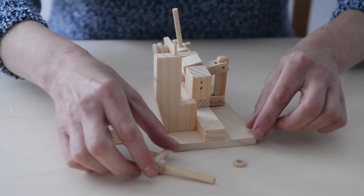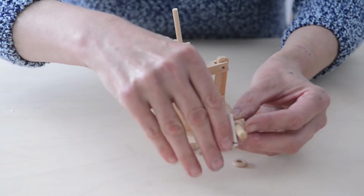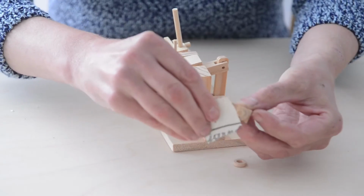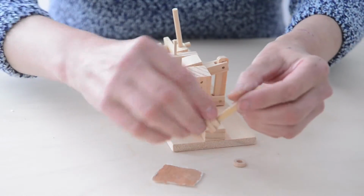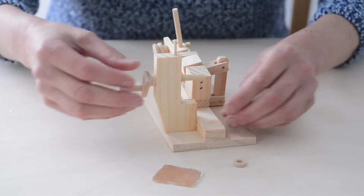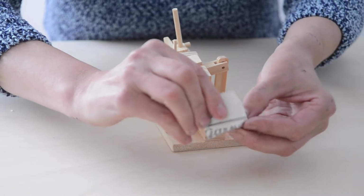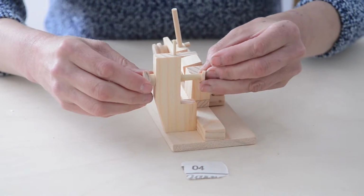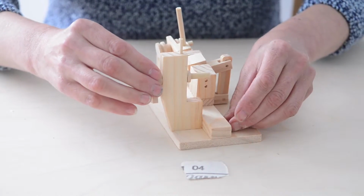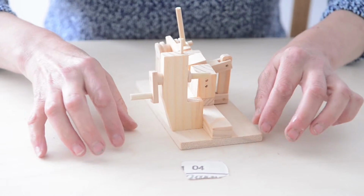On page 9, before you push the handle in, do as I mentioned before, bevel all around the edge of that spacer and wax before pushing it through, and then again the next space you're going to put on, bevel around it, wax and push along, and that way, because this comes under some strain, the sharp edges will not dig in and cause it to bind.